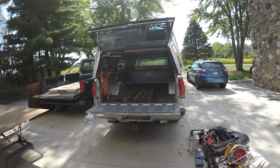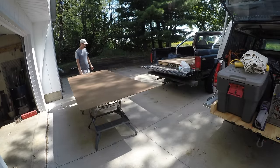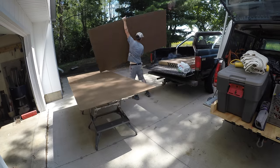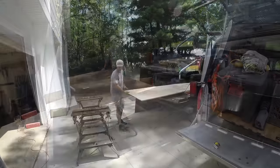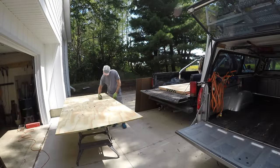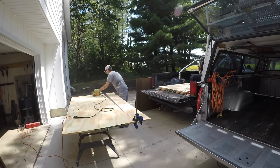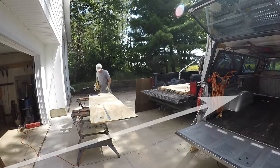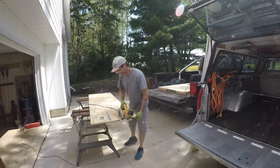So the conveyor belt was out and I decided to build some drawers. I got some hardboard and some plywood. Pretty simple — I didn't want to spend a bunch of money on this. I think I did spend maybe a hundred and fifty bucks, but in the end it was really worth it. I cut this plywood to ten inch strips, meaning the height of my lower section — the height of my drawers — was going to be ten inches. That was determined by my wheel wells. If you're gonna build one of these, you gotta build it custom to the back of your truck or van or Jeep or whatever. My wheel wells come up ten inches, so that's what I did.